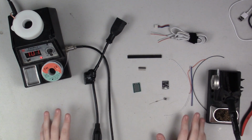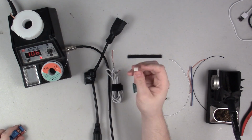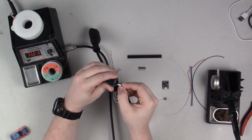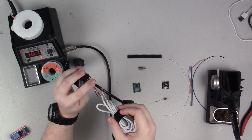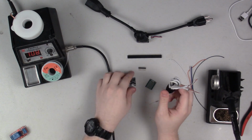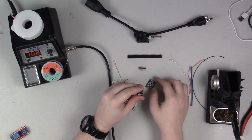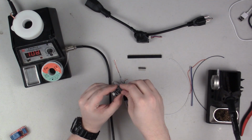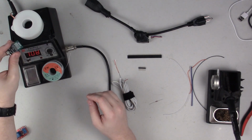The other components that I haven't mentioned here, I'm going to have a chunk of wire. I have a little JST connector, which can connect up to the pins that come out of the relay here. So that'll be connected to there, and then this cable here will connect to those. And the reason for this is that I don't plan on having this module sit right next to the relay, because this module is going to go on this little bit of circuit board here and have the button on it, and I plan on having the button either on the side or on the top here of the soldering iron.